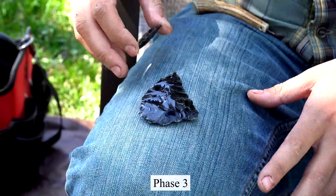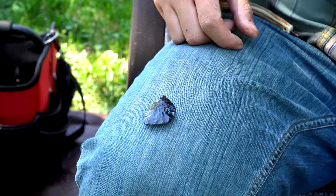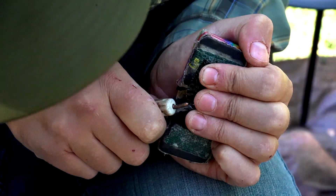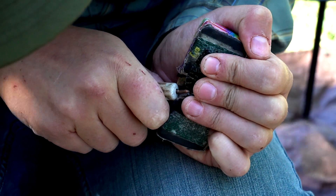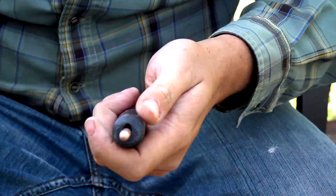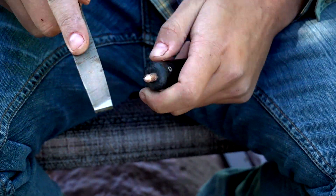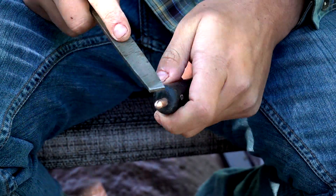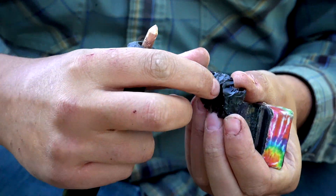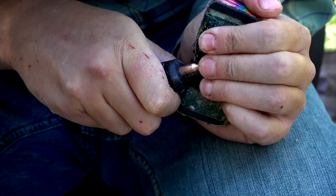We've got it into the beginning of where we want to shape it and give it its final form. I'm going to switch out this piece with something a little closer to a final finish piece, and switch over to my baby tool because it gives me more precision. It's copper and very soft — I bent it and broke it. We're going to sharpen this up a little bit to make the point finer, which will make it easier to get into the notch and make a nice narrow notch. That was a good click — it took off this whole flake right here. Actually putting the notches in is very easy; making them look pretty is a whole other task.